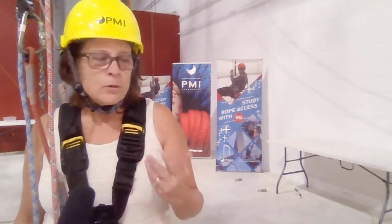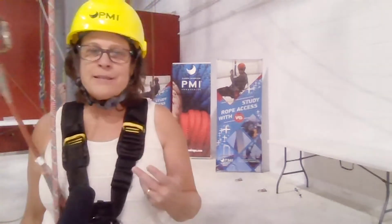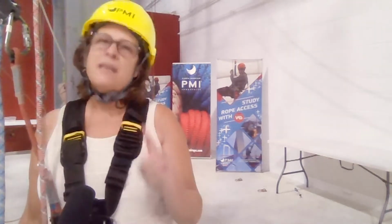So the standard goes on to say in a note, something along the lines of this doesn't mean that multiple attachments can't be simultaneously made to the same attachment point. Gosh, we do that all the time in rope access, especially during transitions, such as at a re-anchor or a rope-to-rope transfer. The note says simultaneous attachments to the same point on the harness are essential to prevent swing fall and protect the worker. The intent in the standard is that the progress system and the rope access safety backup system should not be simultaneously loaded on the same point.